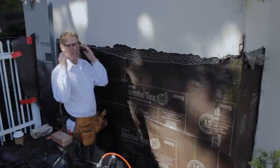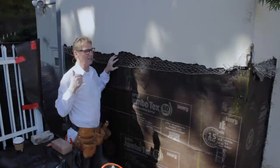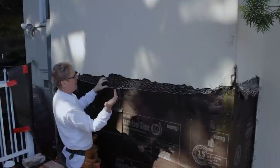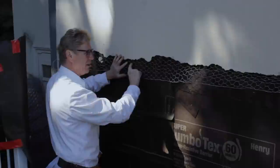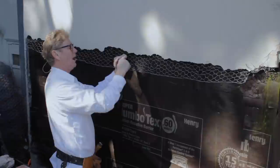What happens if this wall leaks? They call me back — hey Kirk, that patch is leaking. So we've got to make sure it's water-tight; that's the most important thing. What happens if it's ugly? Nothing — it's just an ugly patch job, but we're going to match this on the money. Now, why do we tie new wire to existing wire? Because if I don't, a perimeter crack will appear in one month or even two weeks.